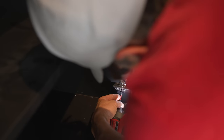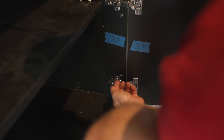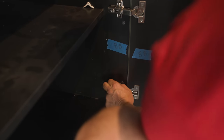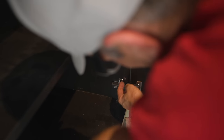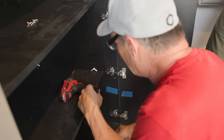That one's no good there — luckily these are slotted. Once you get the height adjusted, you can take the screw out and there's usually enough material to drive the screw in above or below the hole that's already there. This screw here — I can pull it out with my fingers. I could put it right below that one, but I'm not sure where the door's going to end up, so after I get it set I'll come back and put that other screw in.